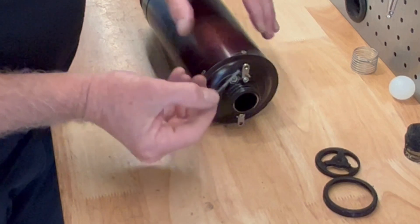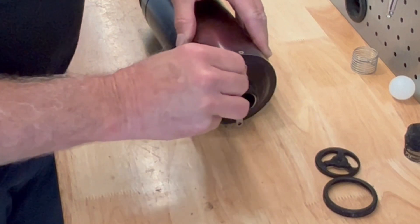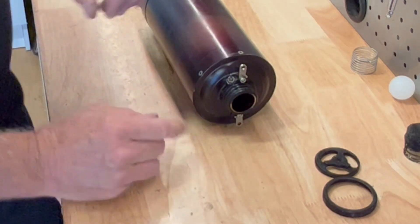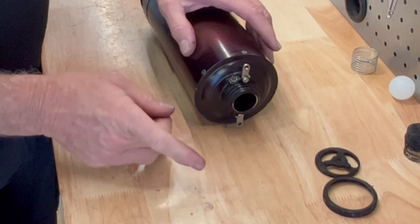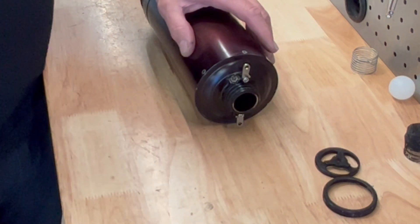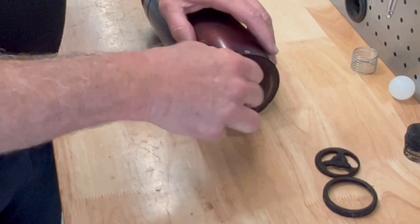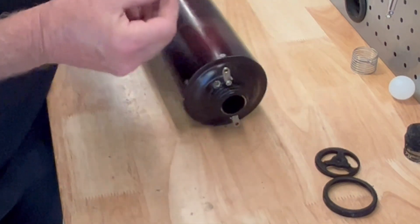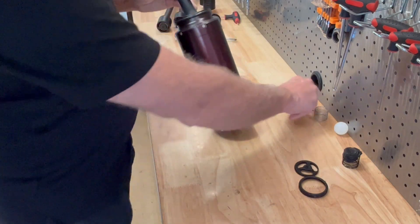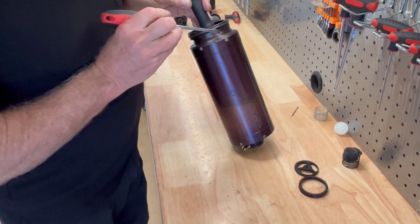With the 2mm drill bit you can feel resistance in there, and you can see the muck coming back up through the hole — so this pipe has built up corrosion in that little fitting. The cooling system runs from the cylinder into the exhaust — the engine will be cooled and water will be coming out of the telltale, but the water flowing from the cooling line into the exhaust has a partial blockage there. That partial blockage is what caused this pipe to overheat and get that discolored appearance.